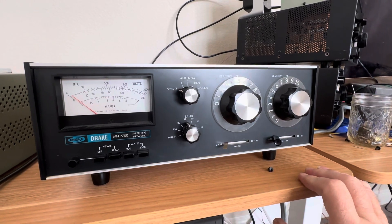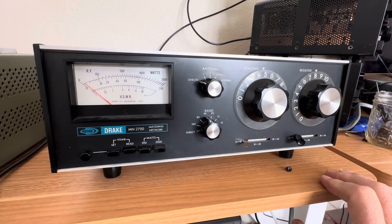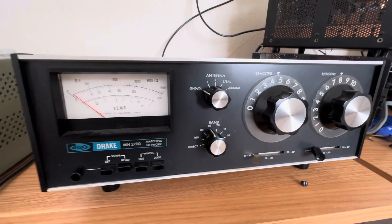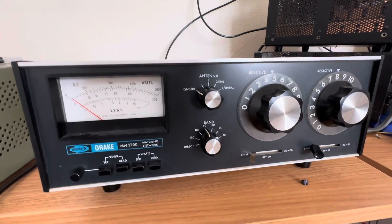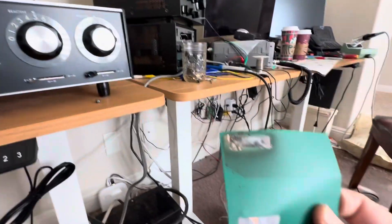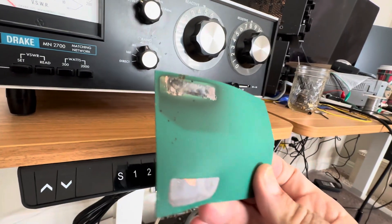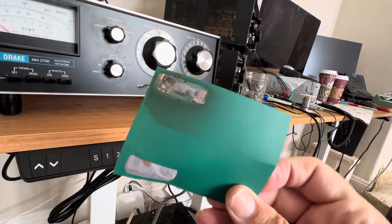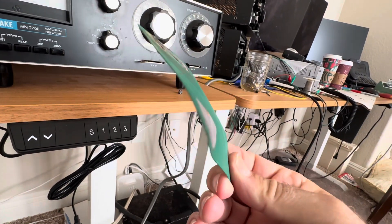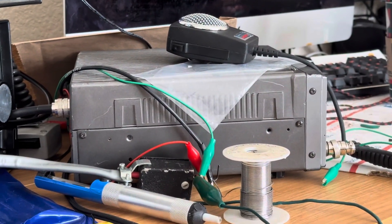It may not have even been broken. I did find some capacitors on the bottom of it — 150 picofarads at 3 kilovolt working voltage — that weren't looking so well, and I replaced those. In fact, they're in the waste basket. This first capacitor here had burned up, so I'm not sure if that affected 40 meters, but I guess it did. Anyway, the worst problem I have now is probably this radio putting out junk on 40.